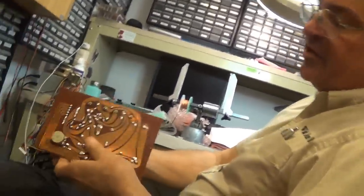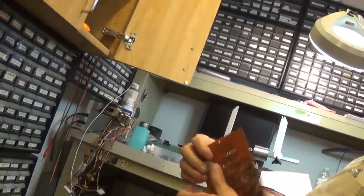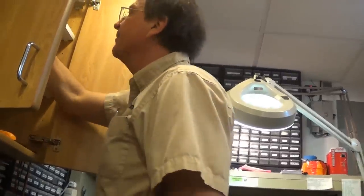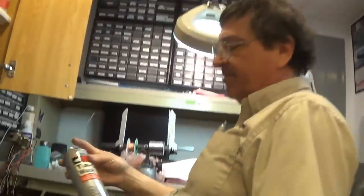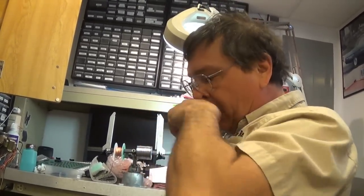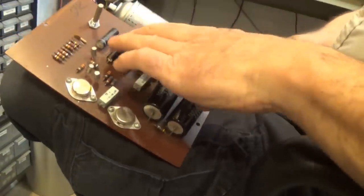And then when you have a potentiometer like this, it's nice to help it work. So back to where we just were, are you going to physically remove all of the solder on that board and replace it all? Am I going to do every joint? No. I didn't think so. I'm going to do the ones that have the service points that I'm dealing with, which is the electrolytic capacitors, whatever you're replacing, and some of the power resistors. And I'll inspect the other ones.